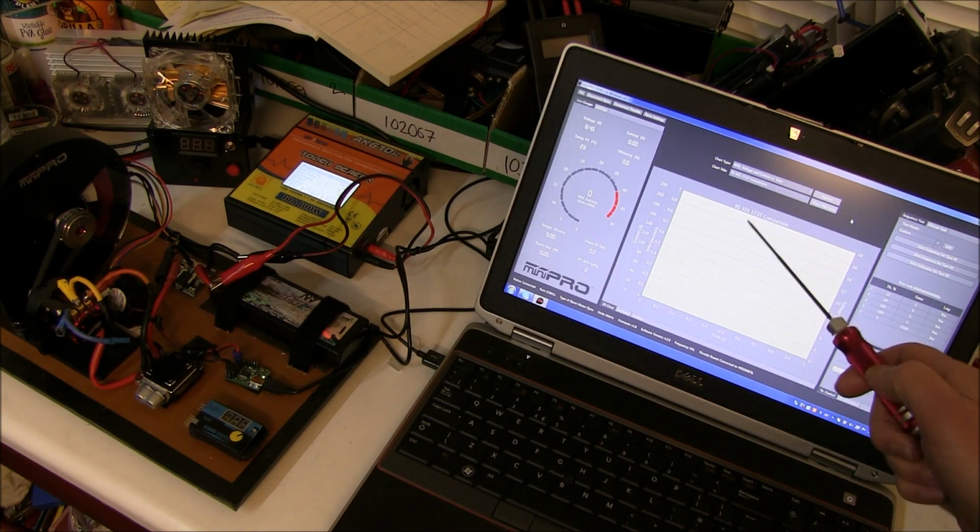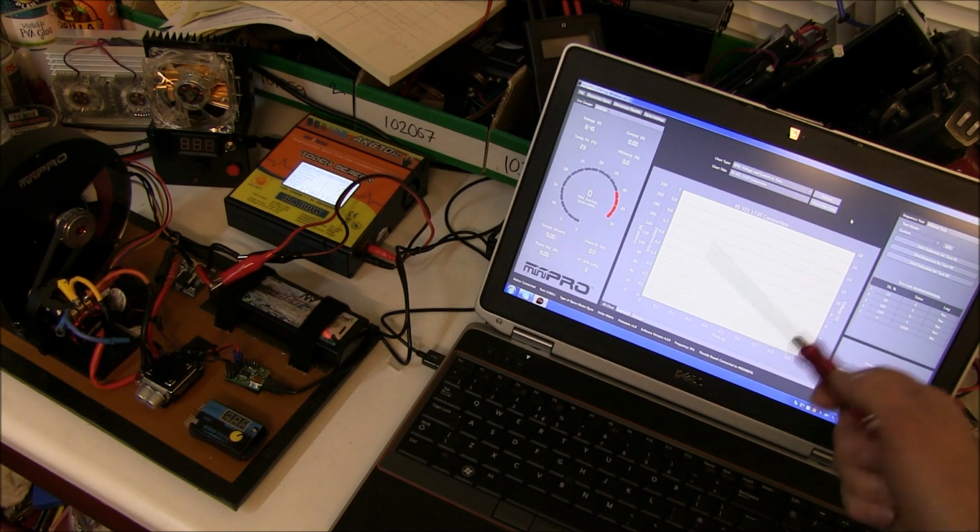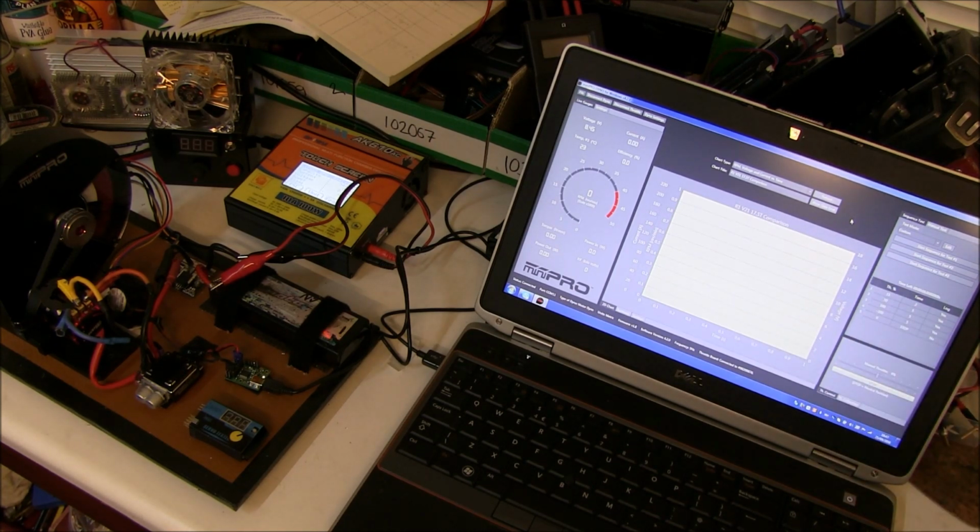I'm going to record the RPM reached and the current drawn, and I can do another test to work out the efficiency. Now my custom sequence for this will do 15% throttle, then 50% throttle, then 100%, and then 100% brakes, which should show you the current draw, the RPM reached and the acceleration speed. So it'd be quite a useful graph for comparison purposes.